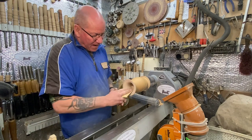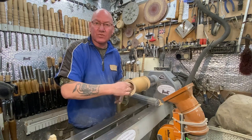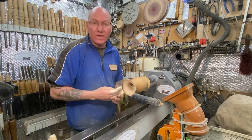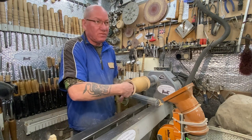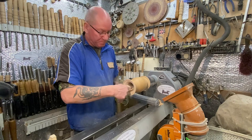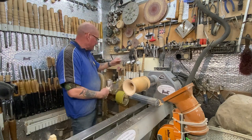And when you get them at the right angles, I mean, people say those 6 mils are aggressive, but it's only because you're using them as a scraper. You're not getting them to cut. You think just because it's cupped, it cuts. It doesn't cut. It only cuts if you present it in the way to cut. You have to help the tool do its bit. The same for any tool.